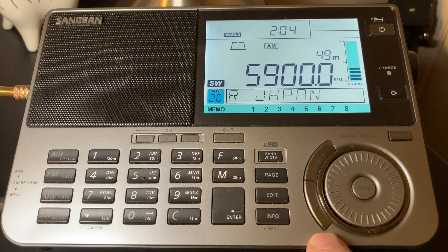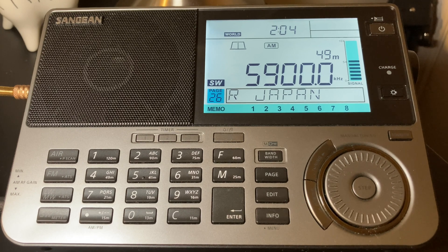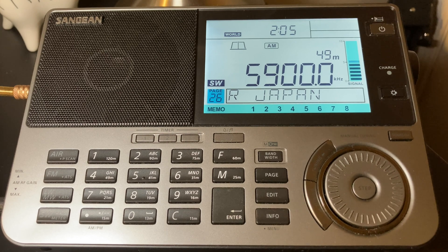This is a Sangean 909X2 and the antenna is an MLA30 Plus. At the moment it's split — I'm not using any additional amplifiers or transformers between the SDR and the radio, so there is going to be some loss. The bigger issue is that under some circumstances there appears to be noise from the SDR that makes its way into the radio, so I'm actually going to leave the SDR plugged into the antenna but unplug it from the power source so it has no power on it — that should solve that problem.